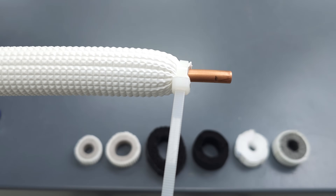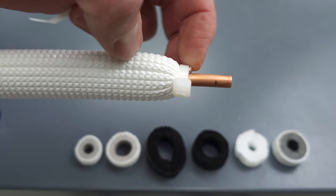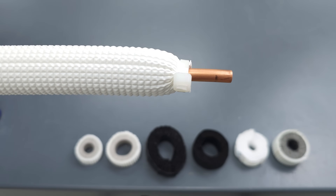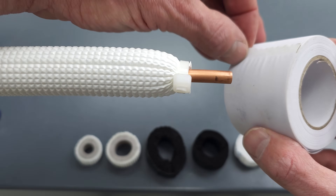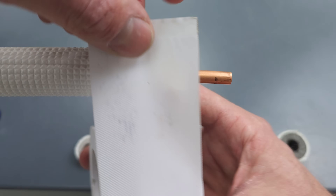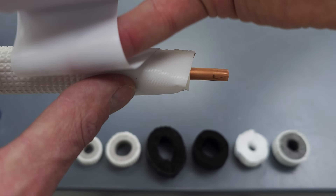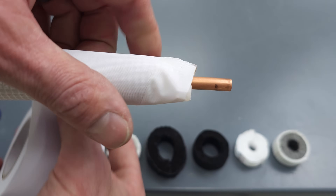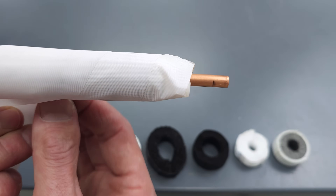What you can do in the meanwhile is close down right at the edge here to not allow any water to get in. You might want to put two zip ties in place. You can use vinyl tape — this is SPVC tape — which is UV resistant tape you can wrap around it. It's not going to stop it completely, but it's supposed to protect that outer layer.